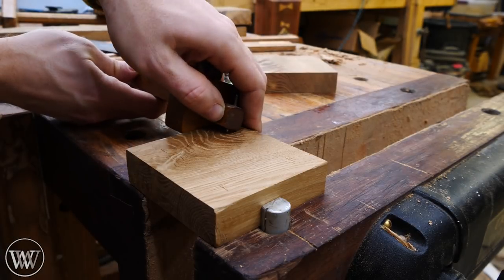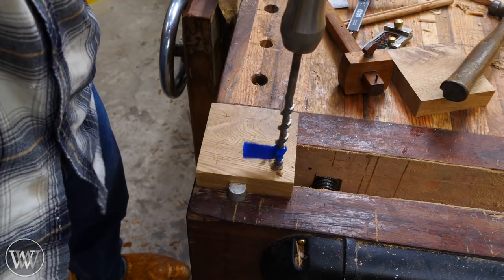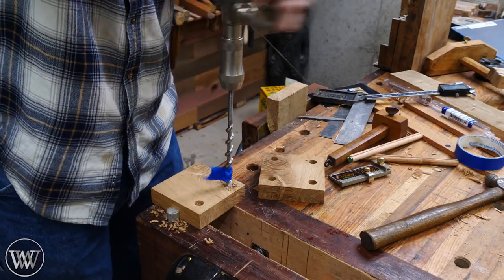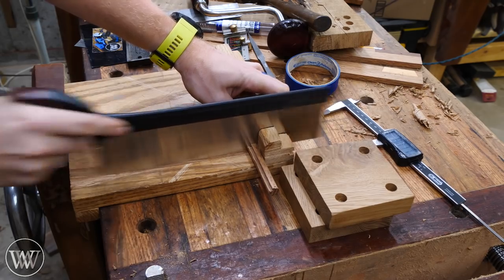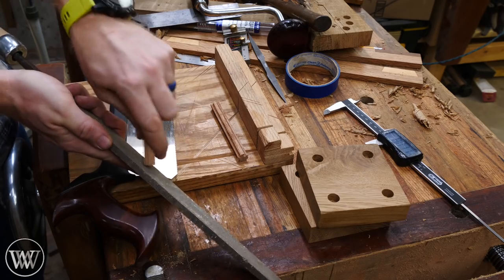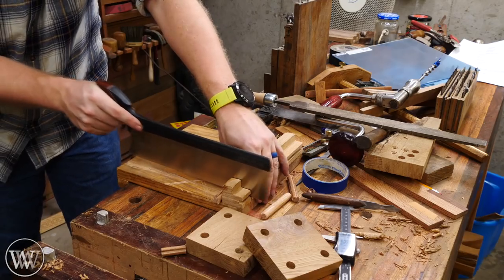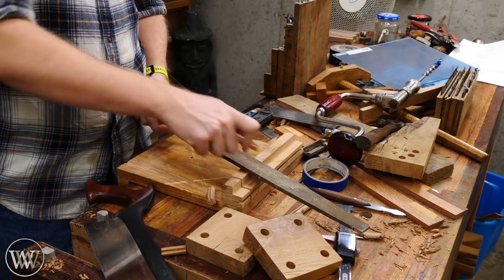Next thing I want to do is drill the four holes for these to socket into, and I put marks in three quarter inch by three quarter inch from the corner. For the bottom one, I cut four holes that were nice and tight and snug so the dowel would fit tightly into them. For the top one, I cut four holes that were a little bit loose — that way the top can slide on easily so you're not burning your fingers when changing the tealight. Then we had to cut the dowel to length. I cut the first one to the length I was looking for, cleaned it up, and then used that one to mark all the other dowels to the exact same length so there wouldn't be any issue of one being longer than another. Clean them all up and get them ready to go.